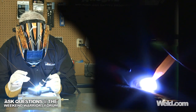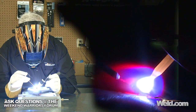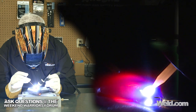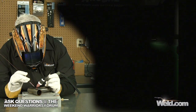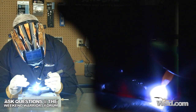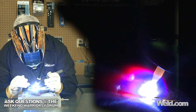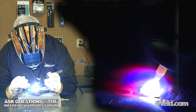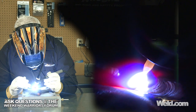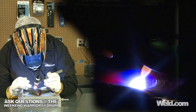Okay, I'm doing one of the final welds on here. I'm doing this with DC straight polarity. My filler material is just 0.045 diameter, and you can pretty well choose the diameter that you like best. Running argon — I'm at about 15 to 17 CFH of argon. It welds really clean.